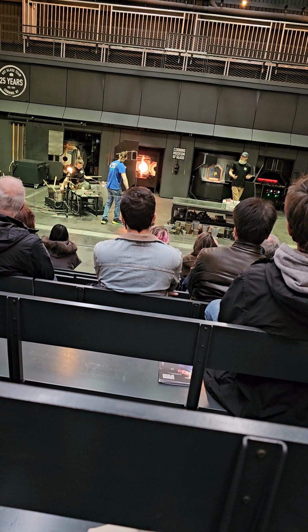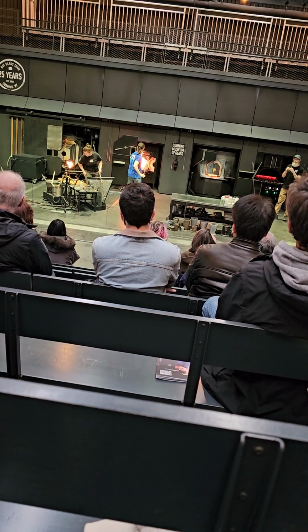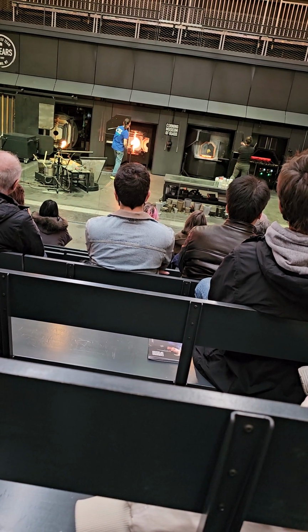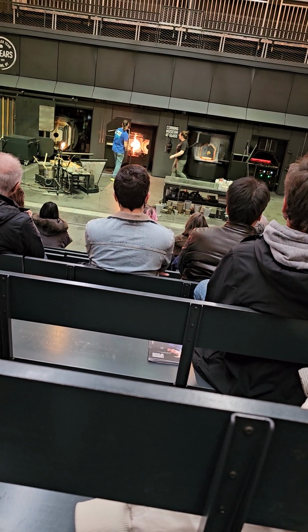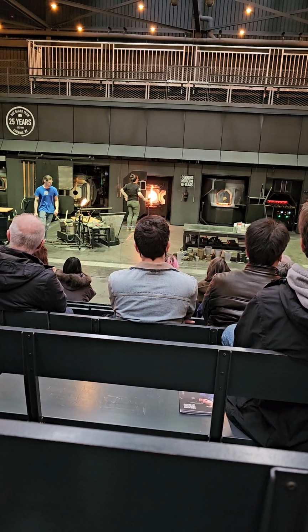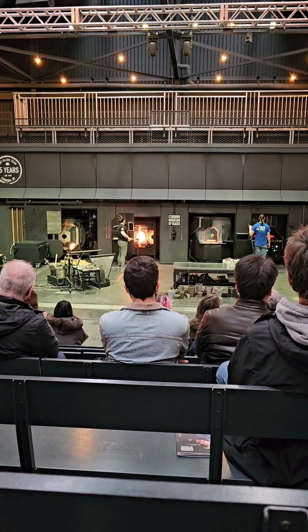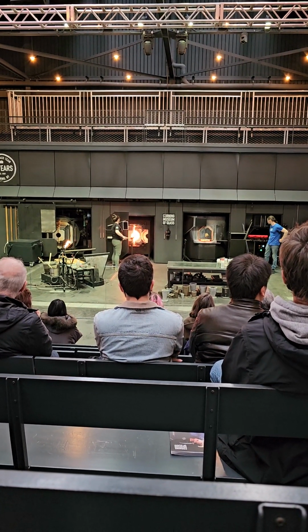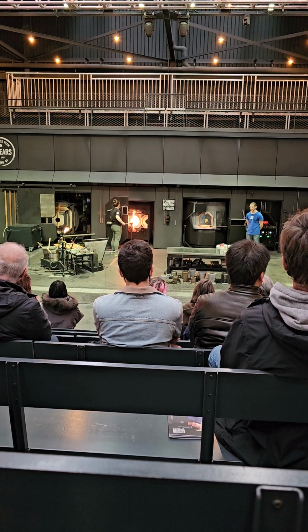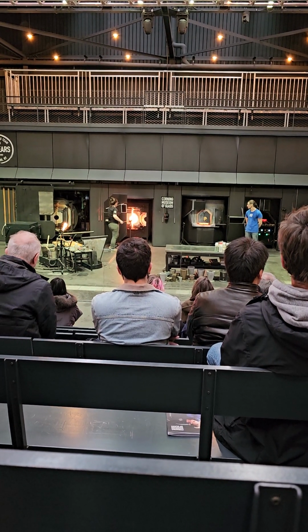This is a really delicate process. This is often where beginners lose a lot of their work because the temperatures need to be matched fairly close. If he's too hot and she's too hot, they'll fuse together molecularly and they won't want to separate when it comes time to put it away into our oven. They become one. Conversely, if they're both too cold, it might appear that they're stuck, but when she applies a drop of water onto that constricted neckline, it causes a slight vibration in her pipe to crack that free from the blowpipe. It would have cracked free from both of their pipes and landed on the ground. So it's a real touchy kind of maneuver that happens right then. A lot of people lose that.